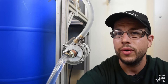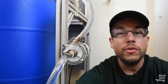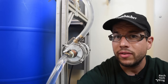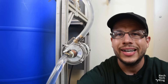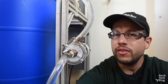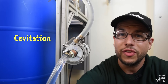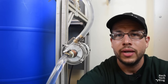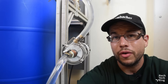If the pump is ever starved of fluid, certainly the pump's performance will be affected, but it's actually more serious than that. It's possible that the pressure at the suction eye of the impeller will drop below the vapor pressure of the pumped fluid. If that happens, then the fluid will effectively boil. Little bubbles will form, travel part way through the impeller, and then collapse at supersonic speeds like little bullets, taking bits of the impeller along with them. This is a condition known as cavitation, and a pump that's experiencing cavitation is not long for this world. Any entrained air or other gas is the worst case scenario for a centrifugal pump.